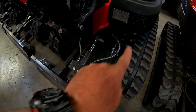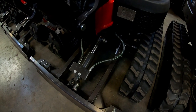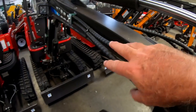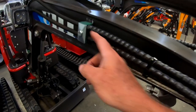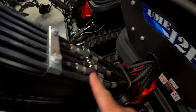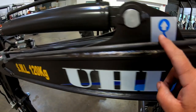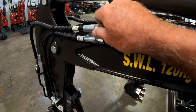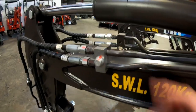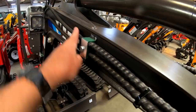I can see that metal protector around the hydraulic line is on the new machine. On the older machine, the hydraulic lines that run on the arm are still rubber hose all the way back into the control. On the new one, there are junctions for the hydraulic hose and then it's in metal all the way along here, connecting back into a rubber hose right at the front. So it's all metal down the arm now, which gives it a bit more protection. There's nothing running down the side on the new one like there is on the old one.